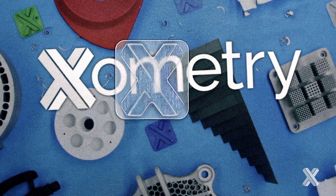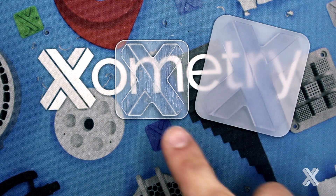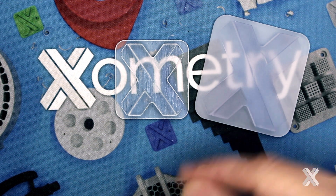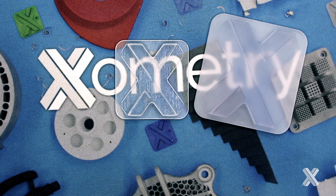If I'm choosing SLA, I have a little bit longer wait — not too long, but it's a couple more days, and usually our standard finish is matte. PolyJet ink droplets are jetted back and forth creating these parts. SLA has a liquid photopolymer vat where a laser cures the material, building a 3D geometry.